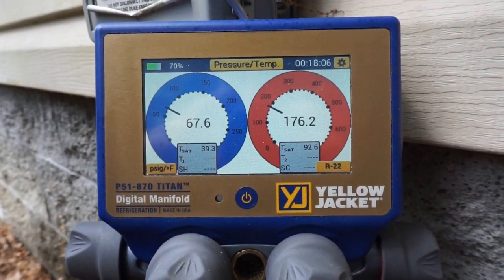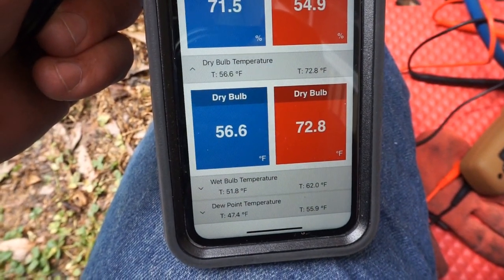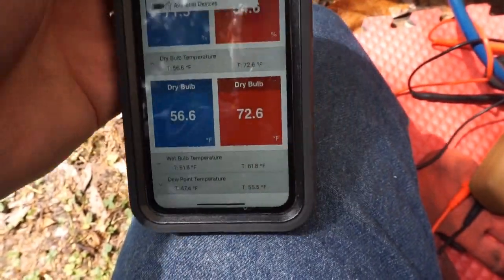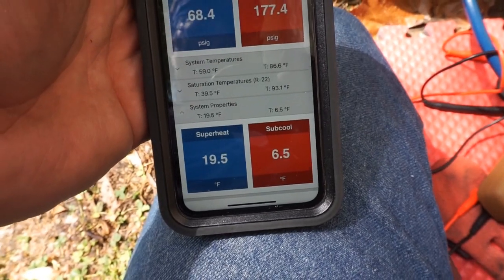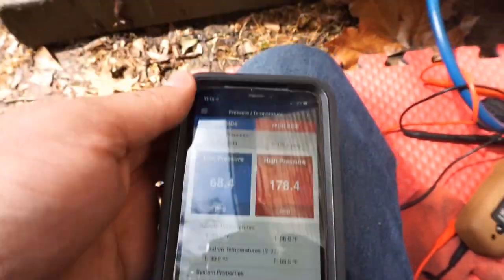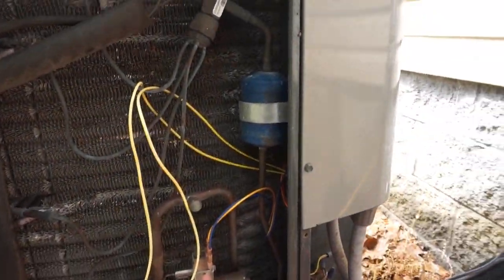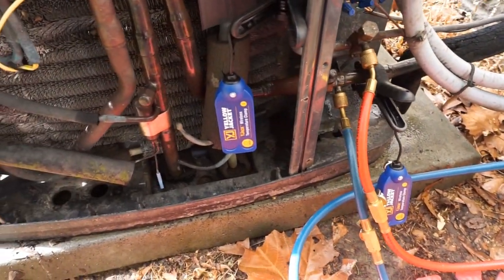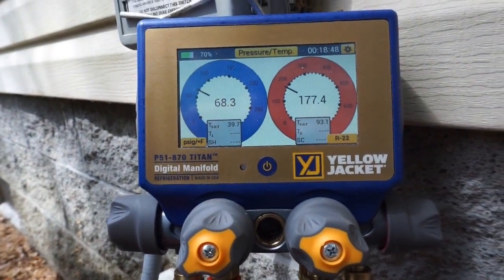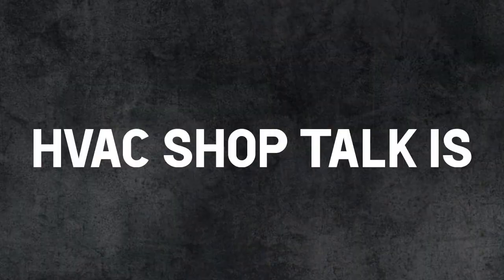We're looking at 18 minutes of run time here, 176 over 68 thereabouts. We have a temperature split of 73 to 56, which is 16.2 degrees — right on the money for where we want it to be. Subcool 6.6 over superheat 19, so we're squared away there too. Overall this machine is pretty good. The concern is going to be our fan motor and we have a contactor to watch. Overall looking pretty good for a 16-year-old system — pretty healthy, pretty happy. We'll give them the thumbs up with a couple of cautions to watch in the future. We'll see you next time.